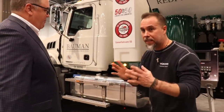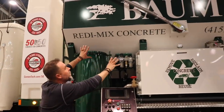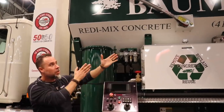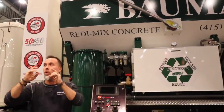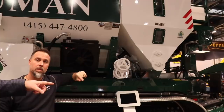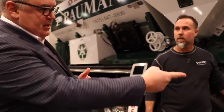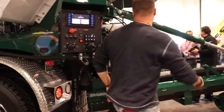Here's how it's done. It's not pre-mixed. So you've got your water tank up front. This compartment right here, this is for sand. This compartment on the other side is for stone, the aggregate. And then your dry powder is actually back here. So you got your cement powder there. And then coming off the back end is a mix bowl, so all the raw ingredients drop into there, your sand, cement, water, admixes. They hit our mix auger, which spins at about 300 RPM. And out the bottom of that chute, you can see right down there, is where the concrete drops.